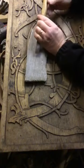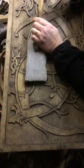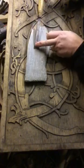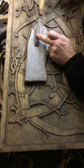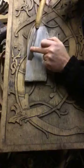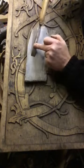So where you can, cut down on all the variables by, say, leaning on something and then applying light pressure. There could be one finger on here against the bench, and people often do this in a figure of 8 motion. So you can get a rhythm going here, and then try and keep as still as you can. I can feel this stone rocking, so when we get this in a block, that'll be a bit better.